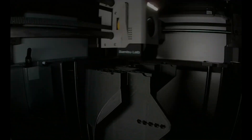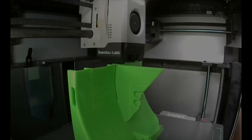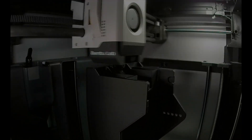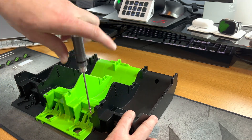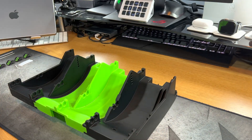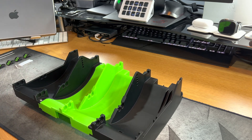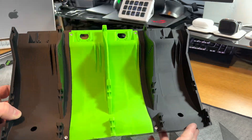There are three parts to print: the left, the right, and the center pieces. They take about six and a half hours each, so it's quite a long print. Once you have all three parts printed, you need to fit them together using four M3 by 20 screws to keep them in place. I did have some issues with the prints — the black ABS print went well, but the green ABS print was very brittle, seemed to have over-extruded somewhat, and is a little bit of a mess. It does fit, but it doesn't look great.